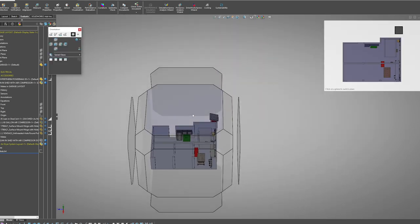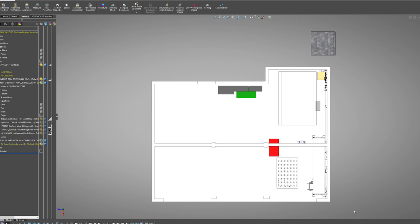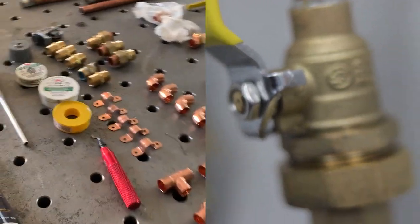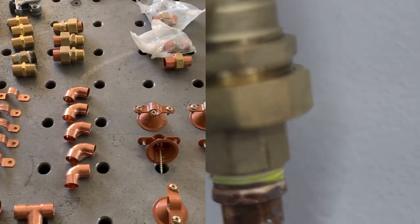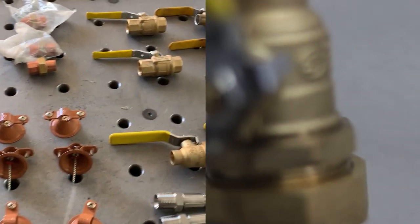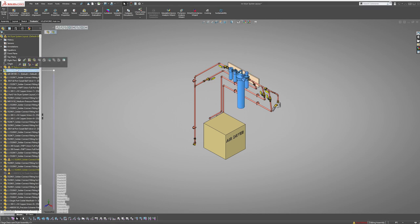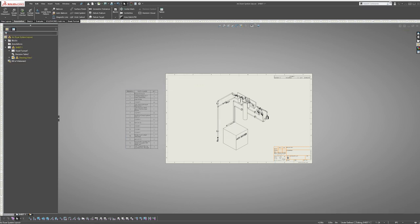Because my shop is less than 500 square feet, I went with half-inch copper pipe versus three-quarter. I think the half inch is more than adequate. I went with copper because the pipe was readily available, and I like all the plumbing supply options — the type of fittings and ball valves. Once I have the system built, I'll go into more detail on the system sequence and the different configurations. With the design direction established, I ordered all the materials I would need. I'll leave resources and links in the video description for the air system diagram and all the items used.